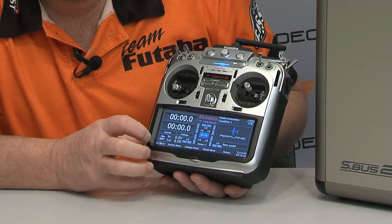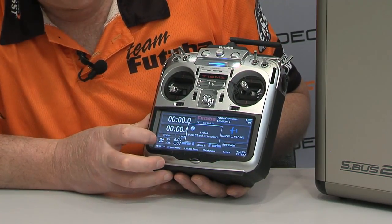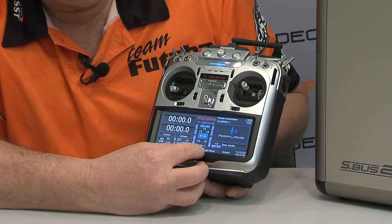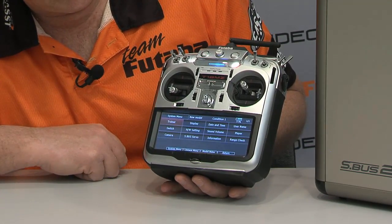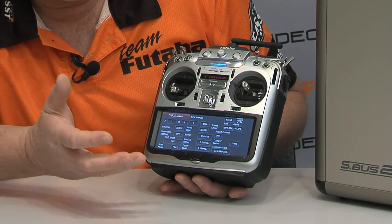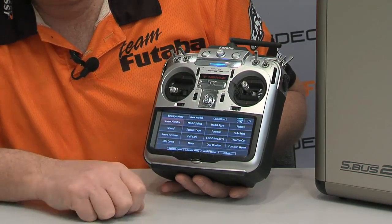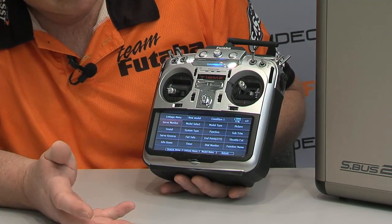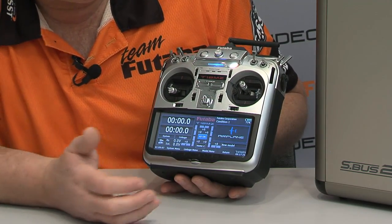Now let's look at how fast this touch screen responds. I'm going to drop into the system menu — you can almost touch anywhere on this screen and something's going to happen. Now the first thing you notice here is that it tells me the screen is locked. That's a safety feature that Futaba has incorporated. So if I hold down S2 and S3, that will unlock the screen. Now I can drop into the system menu. You can see there are all sorts of things here: we have our camera, S-Bus servo program I mentioned, and that's where you go in and program your S-Bus servos. Getting into our linkage menu, if you're a 14MZ user, this is going to look pretty similar or pretty normal to you. There are a lot of the same features, and of course there are a lot of new features in this radio — you can see I'm barely touching this screen and it responds so quickly.